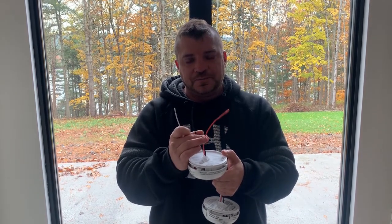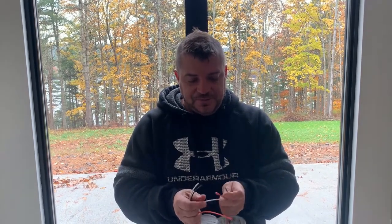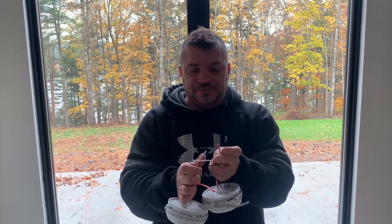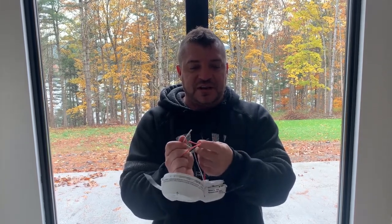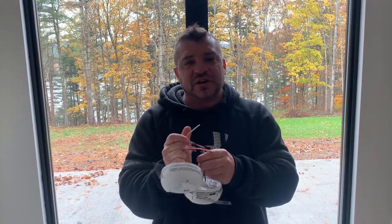It also has a red interconnect wire. We loop the wire from box to box to box, and that has to be on the lighting circuit — the reason being so you can't just shut them off during the event that they're going off, as you'd lose your lights. In the box, we connect our whites together, our blacks together, and our two interconnect reds. If one smoke detector goes off, it sets off all the smoke detectors in the house.